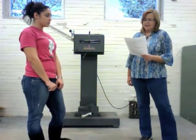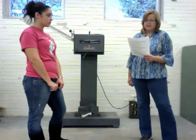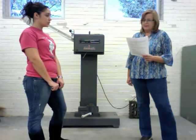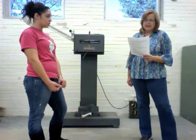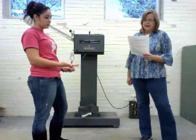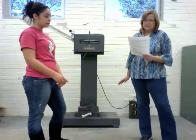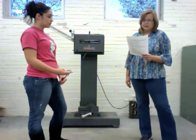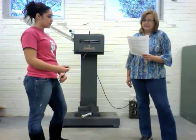The Izod Impact Test is the ASTM, American Society for Testing Materials, method of establishing impact strength. A notched sample is generally used, but unnotched specimens are covered under ASTM D4812. Notched materials are reported under ASTM D256. This test is usually done on plastics, but can be utilized for other materials such as aluminum. The Izod test is used in quality assurance applications to evaluate the relative impact toughness of the material.